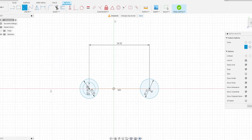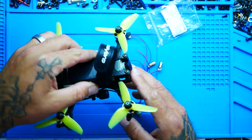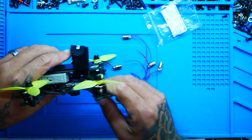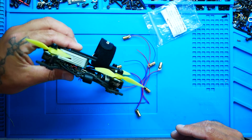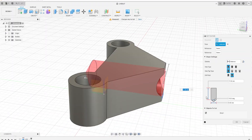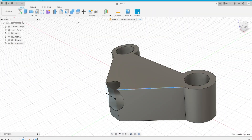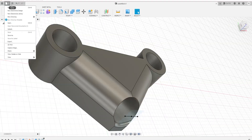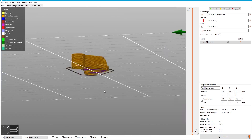So I used my caliper, jumped into Fusion 360, and did some modeling. First I made my design, then I realized I needed some angle on it. The camera isn't pointed exactly straight, and if I pointed the laser exactly straight I'd have to fly exactly straight — but quadcopters don't fly like that. They tilt forward to propel themselves, so I needed to print a mount that accounts for that forward tilt angle.